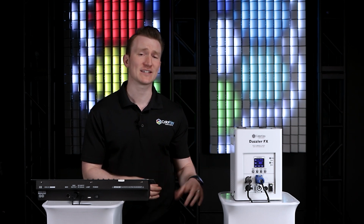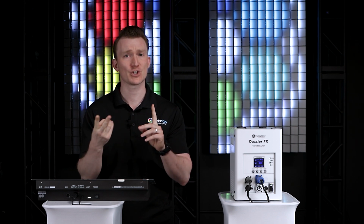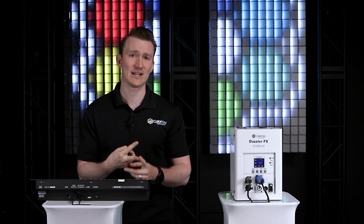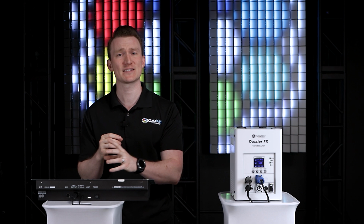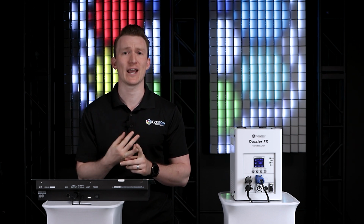Now the Dazzler FX is a 3-channel DMX fixture. Channel 1 is going to control your spark show. Channel 2 is going to cover that clear function, which is very important for properly maintaining and storing your unit. I'm going to cover all that in lots of detail at the end of this video in the maintenance section, so make sure you check it out. And channel 3 is going to turn your heating element on and off.